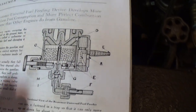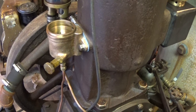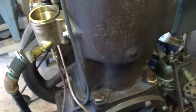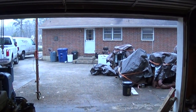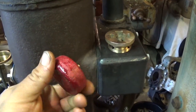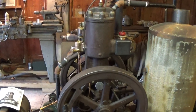So that's pretty much how it works, right as the piston is uncovering the intake port. It's a pretty neat device and it worked very well the short time that I had the engine running before it started to flood. So hopefully with the correct float it should operate properly. I was going to go ahead and do that now, but it started to snow. This is going to be a project for another day. Plus I should probably give at least 24 hours for this red coat to set up — it's still a little bit tacky. I'll get back to this engine shortly and you can see it run again. Thanks for watching.